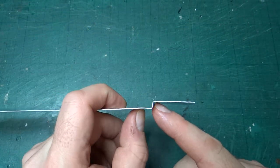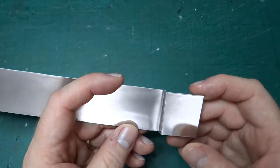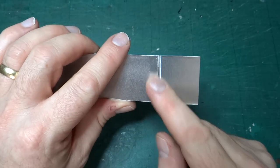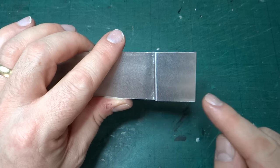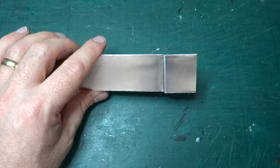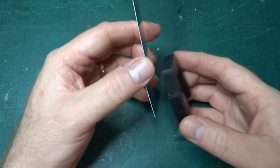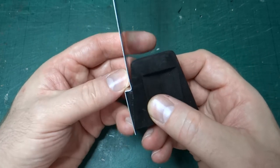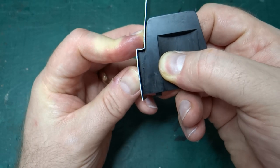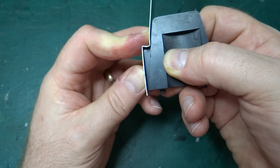You can see it's still not quite as sharp as the first one, but it does seem to line up quite well. I did notice that on this piece when I made the first fold I didn't get it particularly straight, so this edge isn't straight and the whole thing's a bit twisted. But I think for the purposes of proving whether the method works or not this is okay. Having forced this second bend sharper we can see that it fits much much nicer.